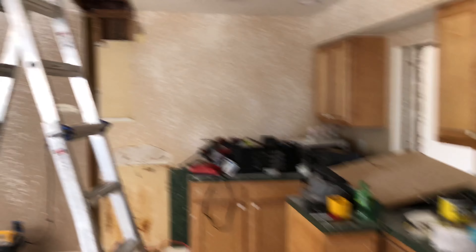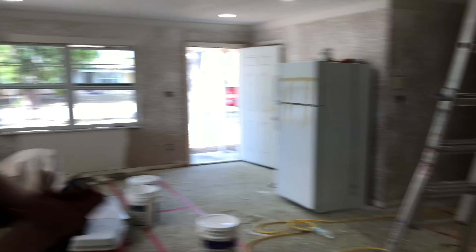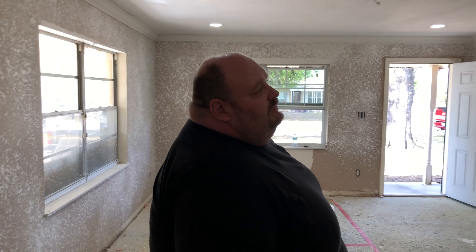He also showed me what he did over here. One of the issues was there was a junction box in this wall and it was covered — that is a no-no according to code. The issue is, if you ever have any problems with that, it's buried. You don't know it's there. So we got it up in the attic and got that taken care of.